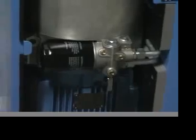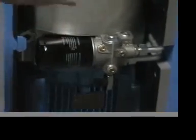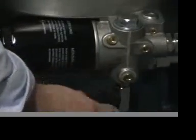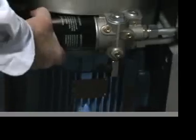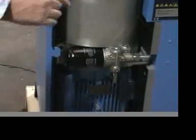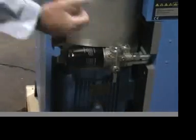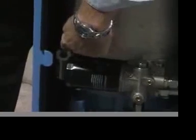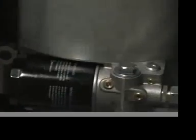If you're going to change the oil, you open this valve. We have oil in it — it's new oil, it's a brand new machine. Open this valve, drain the oil. While that's draining, go ahead and unscrew your oil filter, take it off. Take the new oil filter, put a little bit of oil on the sealing ring, turn it back on. Fill the oil — when you put oil back in here, you look at the sight glass. You fill it halfway. Once it's halfway at the sight glass, you're done. Replace the plug — you've serviced the machine.